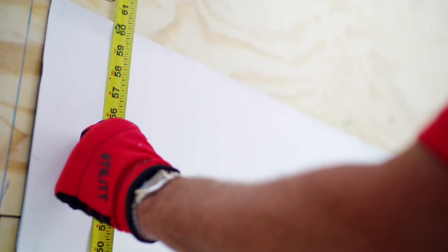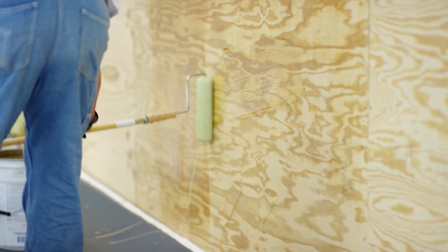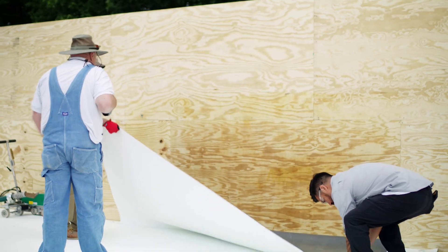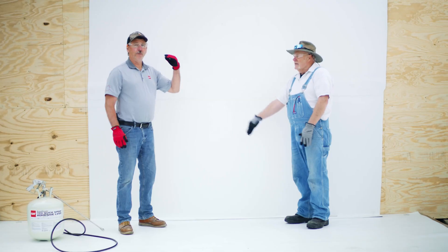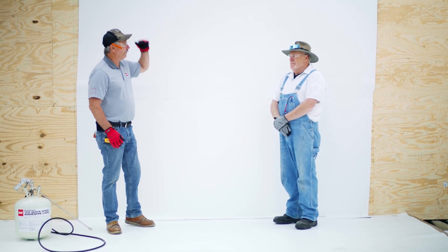We use the five, and this is 54 inches. So if you're using standard bonding adhesive — the bucket adhesive — we use a 60-inch sheet, which is a five footer. We have six inches on the flat, so you're at 54 inches. At 54 inches, we need a mechanical termination. If this wall is 100 feet high, you can do it, but every 54 inches you need termination.